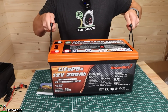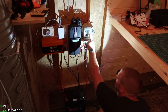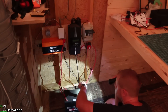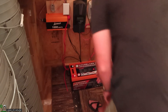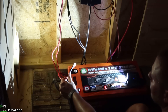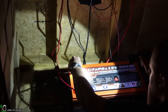The attached carrying handles make it a lot easier to carry, which is really nice — they just fold down out of the way. I've got this 1000-watt inverter we're going to be using to test the new battery here in the studio. I need to disconnect the previous battery, so I'll turn off the solar from outside and then shut off the power to the Midnight Classic. Everything is off and now I can remove the previous battery. I'm placing the EnjoyBot down here, popping the little plastic covers off the battery terminal, and getting the red and black wires connected. We might see a little spark — shouldn't be too big though. I'll put the little caps back on to cover those exposed screws.